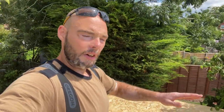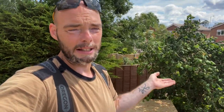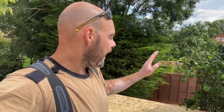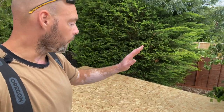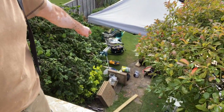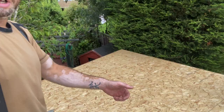Now I'll get my tools down and have a little reset, because down here there are offcuts of wood where I've chopped stuff and I don't like working in a mess. I'll get that all cleared out, get it in the skip. Then I'll go around on the inside and get rid of any nails that have popped through where I've missed joists - even when you mark them up sometimes you miss. I'll run a disc cutter, clear up the site as a reset. Then if the rubber roof hasn't turned up I'll start putting breathable membrane on the outside of the building. There's also a blower down there in the corner - I'll use that to blow off any debris before gluing the rubber down.